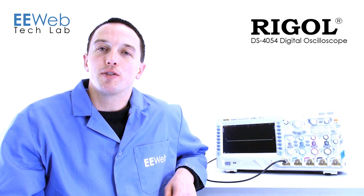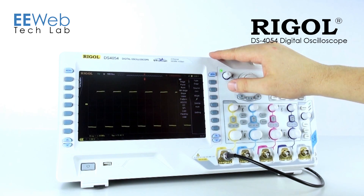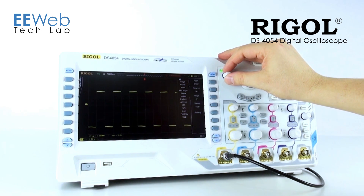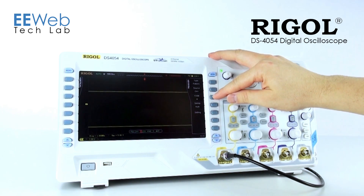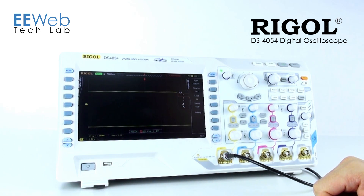This scope has some features unique for its price range. One nice feature is the various triggering modes that can be used. If I go to the triggering menu, I can set up all sorts of different triggering functionality — whether you use a traditional edge type trigger or communication type triggers. There are even custom triggers that can be set up using the pattern function, where you can set your different codes for your different patterns and you'll see your pattern displayed here. So you can set up a triggering pattern based on the communication type you're using if it's not built into the scope already.